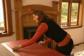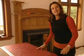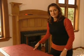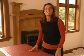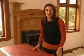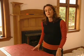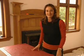The traditional method is to book pasted paper while it relaxes. Simply fold the pasted sides together with a larger fold at the top to indicate the top section. The advantage of this technique is that you don't have to rush to hang the wallpaper. Depending on the temperature, you can leave booked lengths of wallpaper for extended periods.